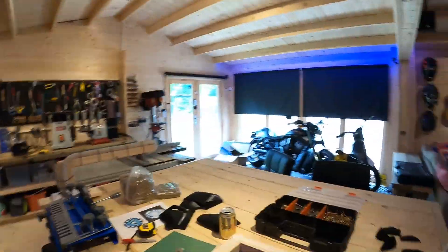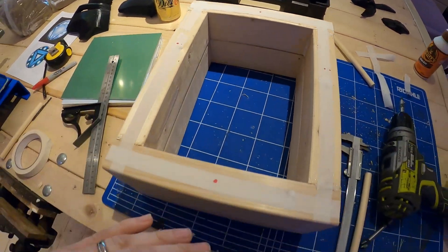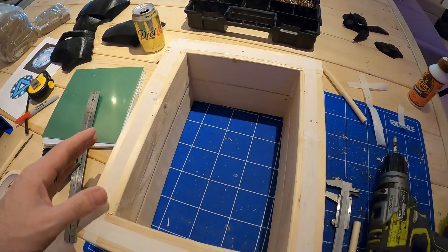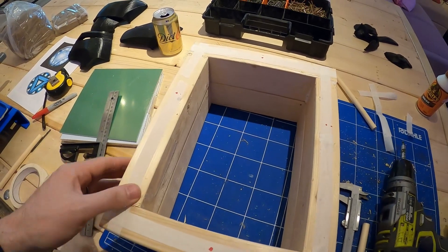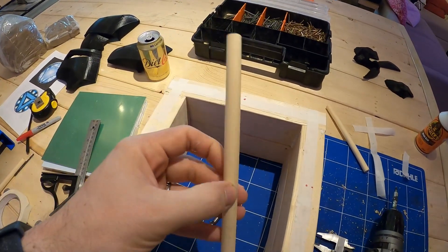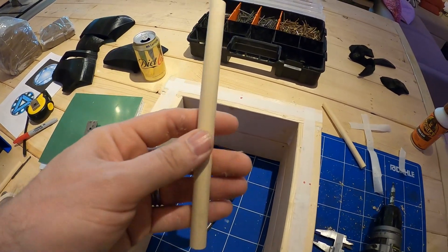I've strapped the cope and drag together with masking tape so they can't move, then marked for drilling. The holes are off-centred on the wood, and the reason is that when you put the two sides of the mould together they can only line up in one direction — that saves you from printing two halves disjointed. We're going to use the pillar drill with a 12mm Forstner bit, since we're using 12mm dowel, and we may need to sand the hole slightly so it's easy to place.